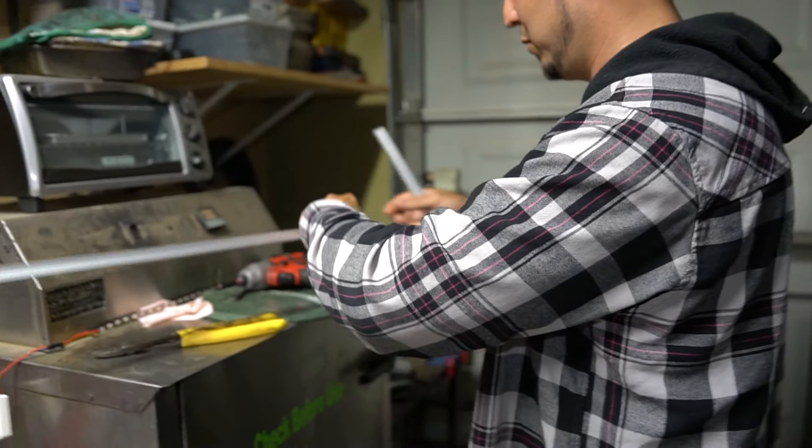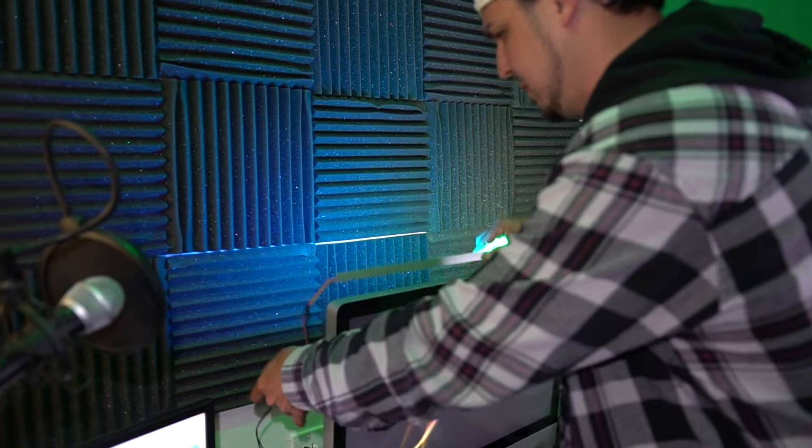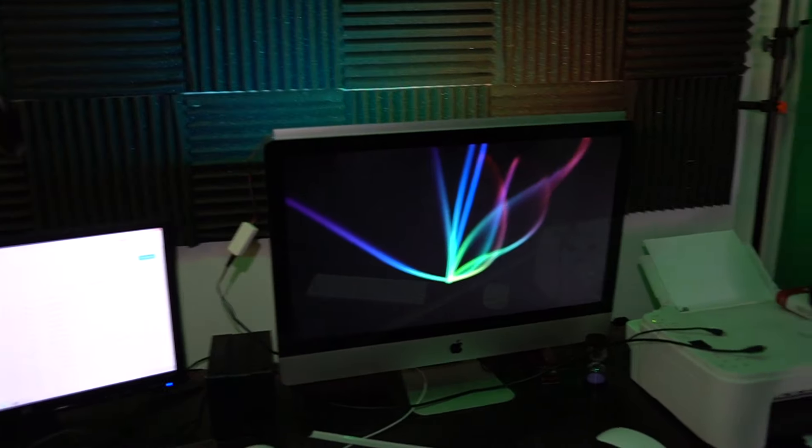That was not an efficient way to do it, but it worked really well. So that was stupid — any excuse to use Milwaukee tools in videos, I'll do it. It looks stuck, right? That's pretty cool. It was an accident that it turned out as good as it did. I should probably just hide the LEDs on the other side so that you really just can't see them. I have thermal tape and I'm using the double-sided tape because John was showing me — on the back there's actually contact points that technically touching the aluminum could bridge. So with the thermal tape on the aluminum and then that sticky translucent tape on the back of the strip, we should be all good to go. I've also got some more thermal tape doubled up on the bottom. So literally all we have to do right now is stick this thing to the top of the monitor, plug them in, and enjoy them.